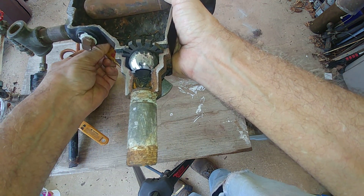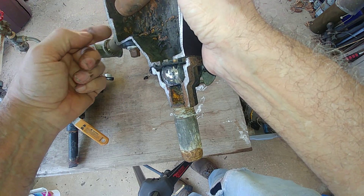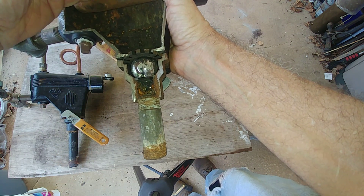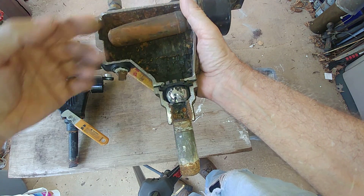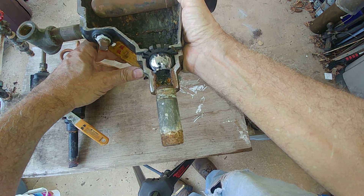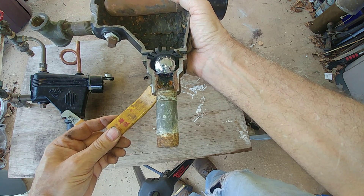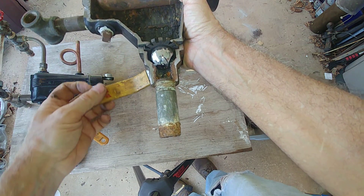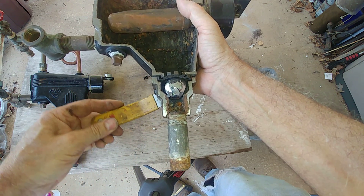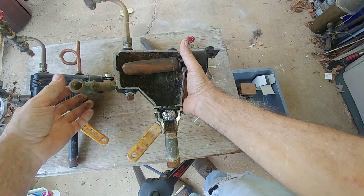This port here is more or less three-quarters inch, larger than the half-inch entrance. So when you open this, the contents of this chamber drain faster than the water comes in. As soon as the flow slows down, the best thing to do is shut it, let it go up again for a second, then open it maybe two more times until the water comes out like weak tea — then you're done. You're never going to get all of the rust out; there's always going to be rust. It's really good at generating rust.